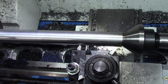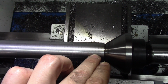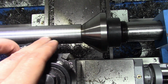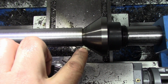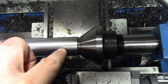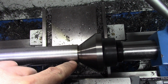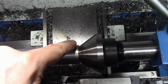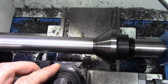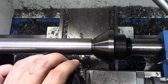Now this is the first hammer I've made since I got my lathe, so now I can precisely mark this out. These are basically going to be cutting guides. This isn't going to be the shape of the rings, but it's going to be where I start the cut, the angled cut in towards the center at each one of these markers. And then when I have to cut from the other side, I'll have an exactly identical line that corresponds to the other side. I'll explain more once I actually start doing the cutting, but this should give me a pretty nice guide for cutting these rings out.